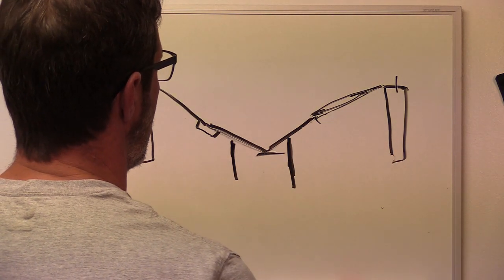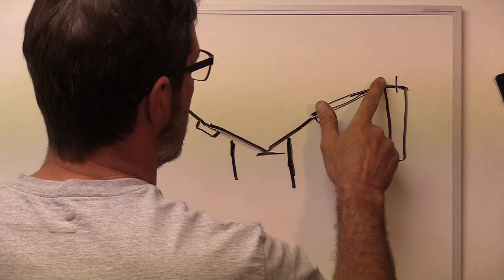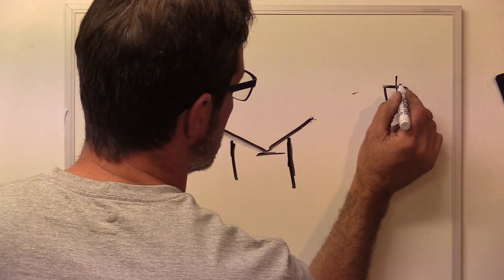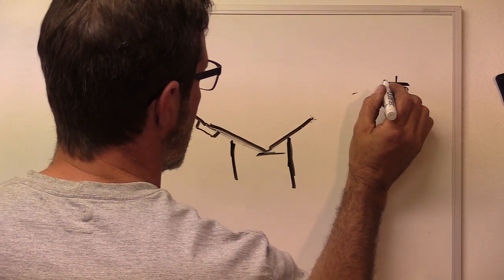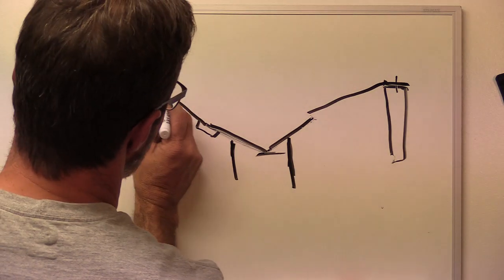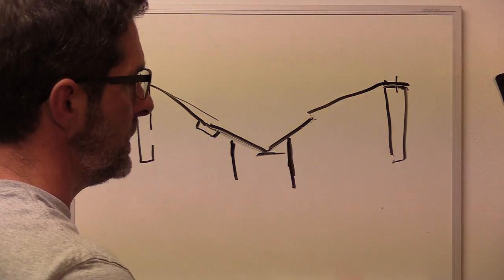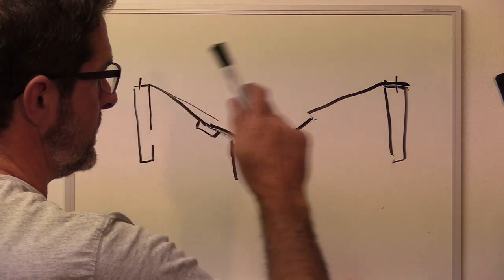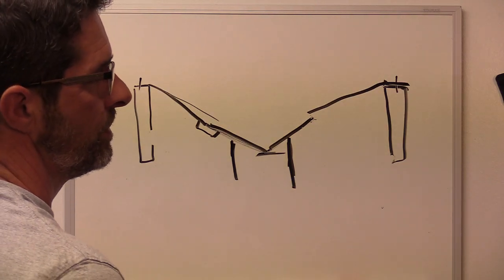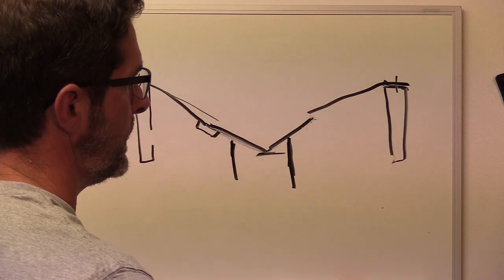But that drop on that side is wrong. I don't have any reason to think it's right. But this piece here, the bent chine, comes down. If it meets there, and that's the right angle for the boat to match the sides, that's where it needs to be. And so I essentially have to fix the sides, build the boat independently of the keel, and attach them wherever I need to attach them for the rest of the boat to be right.